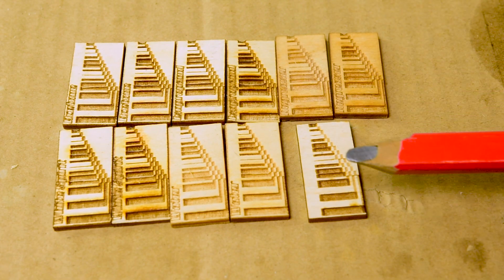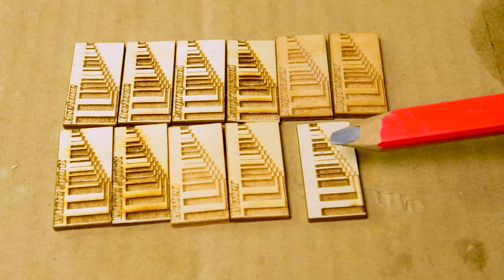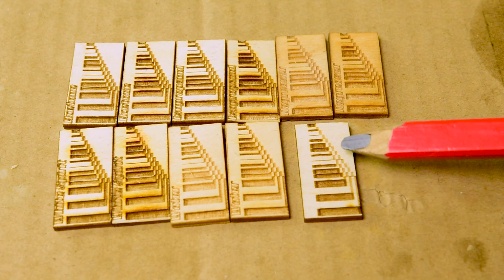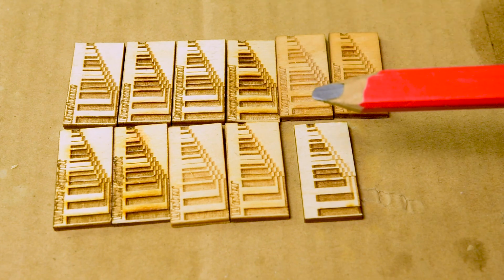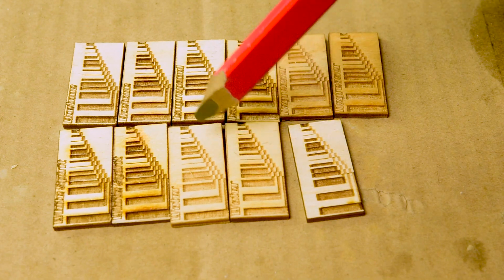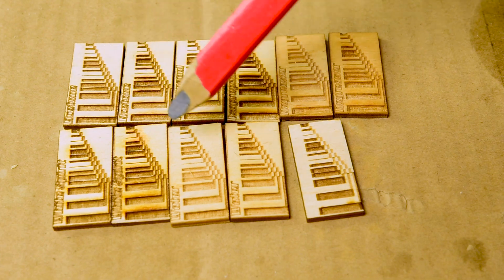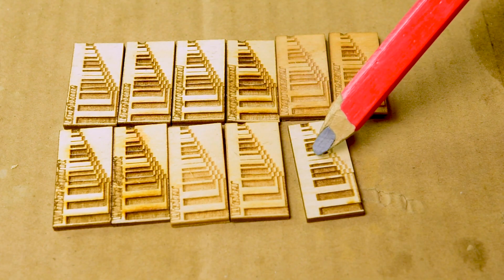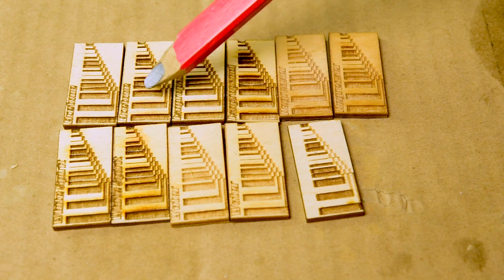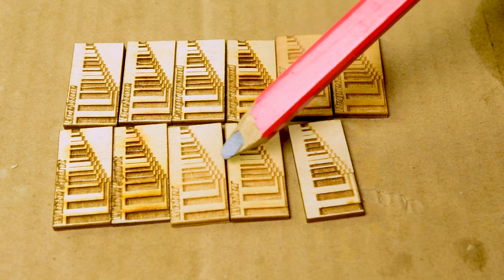So obviously the most optimal solution is a piece of masking tape or masking transfer film on top of your material, but if you're doing extremely complicated engraves which have a lot of details to weed, you may not make that a possibility, especially if you're doing photo engraves. So water is an interesting way of going. Acetone is probably the good halfway point between water and just clean, because the acetone does decrease the amount of residue, but it doesn't do what the water does as far as spreading it throughout.